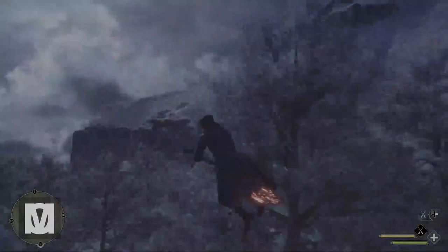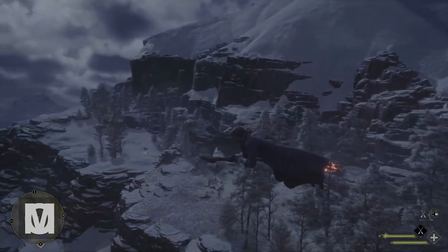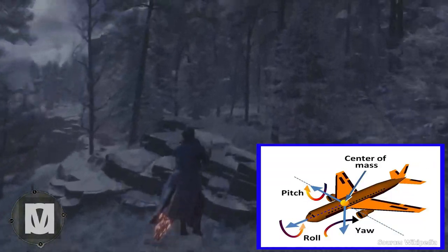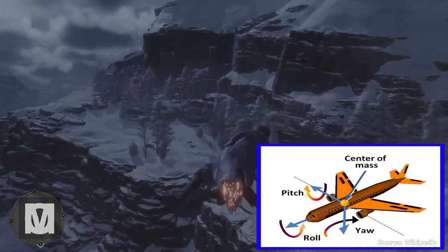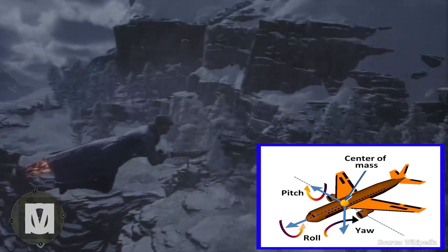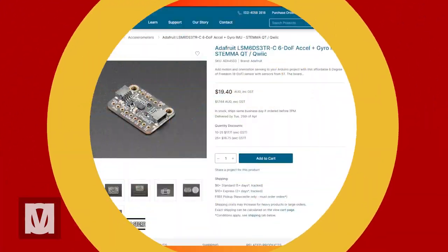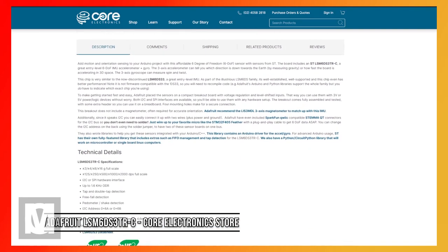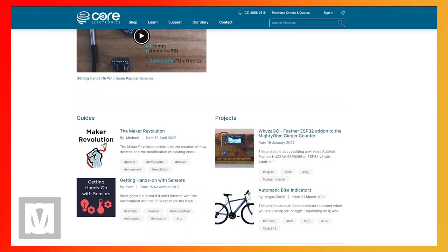The most important aspect I decided to focus on was the ability to determine the pitch and roll positioning of the broom. I analyzed the broom movements in-game and in the films — I noticed that the broom rider pulls up and down on the broom and that they twist the broom, replicating the roll movement left and right. This led me to deciding on getting an accelerometer. The accelerometer I chose was the Adafruit LSM6DS3TR-C — it has both accelerometer and gyro functions.